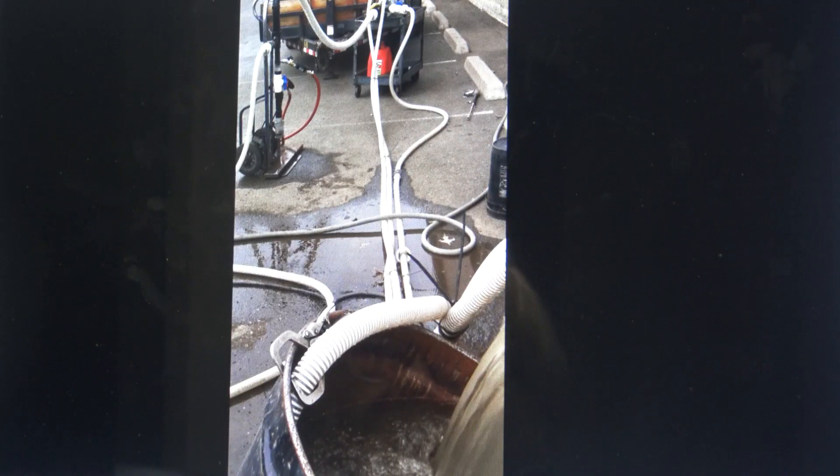Now I'd like to show you what my research has developed. This is a shot of a river system I created in order to test the Gold Drop as a dredging system. The barrel in the foreground is my suction barrel. I have a two-inch line sucking three-eighths minus material through the Gold Drop there on the left in the background, then through the pump in the very background, and the discharge line comes up to the barrel on the right creating a waterfall into the suction barrel.